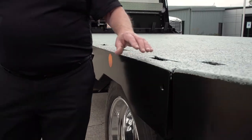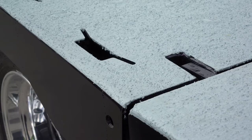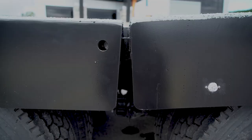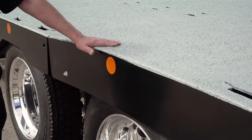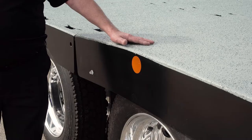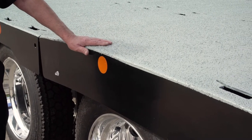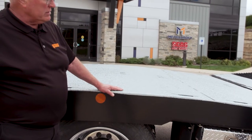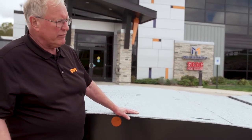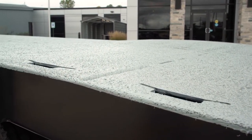The mechanics of the deck are very simple. It's hinged forward to the axle, which reduces the overall length of the truck while still providing a very low load angle. The rear deck also has a curved shape, which allows loading very low ground clearance equipment without having to raise the rear deck to clear the hinge line, and also aids in loading tracked equipment — it can simply drive up over the curve without breaking over and slamming down onto the deck.